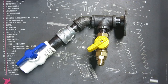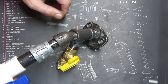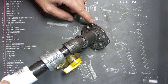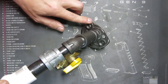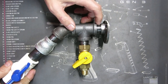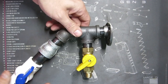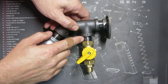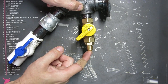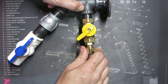So let's take a look at it. Everything you see here I bought on the pipe aisle at Home Depot. Starting with this mounting plate — I cut it with my angle grinder and sanded down the sharp parts in order to get around the muffler. From this base plate, we go to a half inch sleeve, then a half inch T, then going up this way another half inch sleeve. Then I have a valve and an adapter that makes it so I can screw the gas hose on easily.